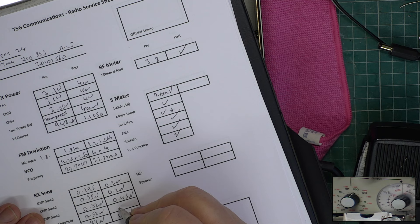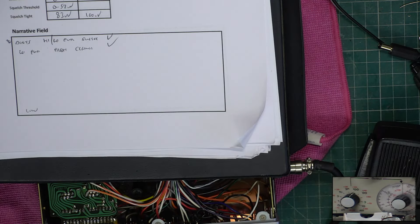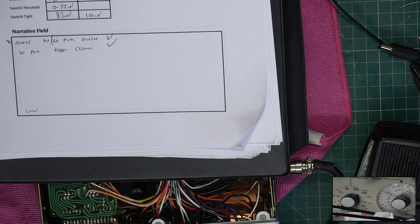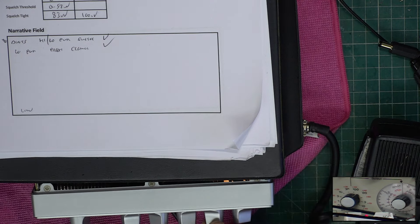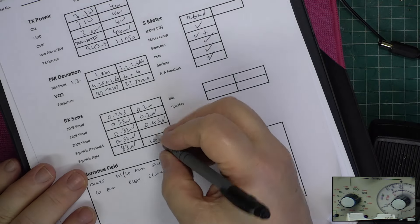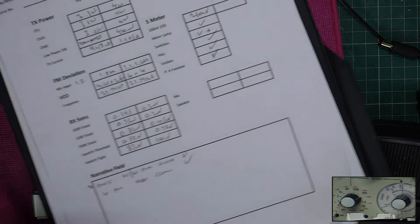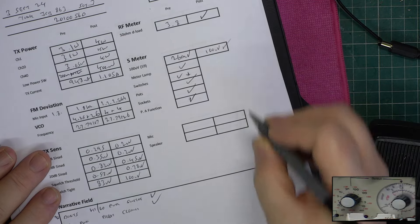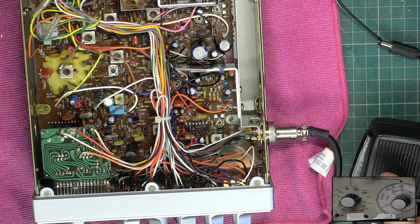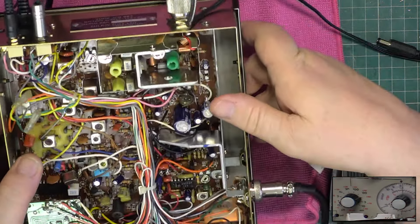That's why I do these in the sequence I do them. Oh — minimum! We haven't done minimum. So, attenuator on the signal generator — I'm parking it at 0.3 of a microvolt. Set the squelch on the radio. Signal generator back on — 0.78. Excellent. So that's been done. That's another really good set. And then you know what — I'll come up to one of these and it'll be 0.7 of a microvolt, it won't be 0.2. They're not all the best of the best.